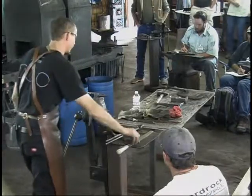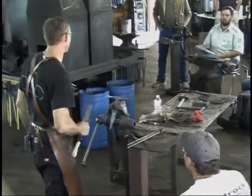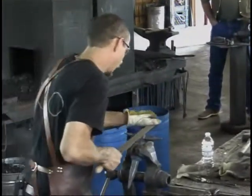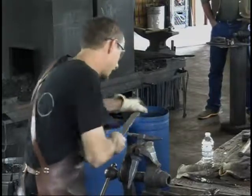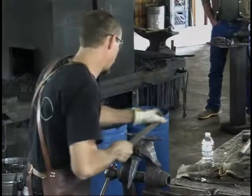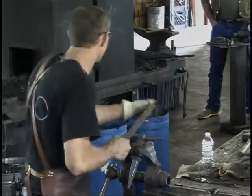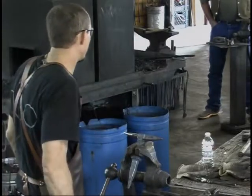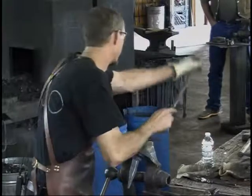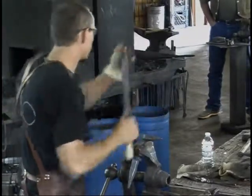Like I said, I keep a very smooth, half-worn mill file, and I test the edge. If you're eating the metal off, it didn't harden. If you can bite a little, but it's very resistant, it doesn't want to, but the file bites a little, you're pretty tough. That may be acceptable as it is. This last one, the mill file slid off of it. It knocked the scale off. It didn't do anything else. It just slid.